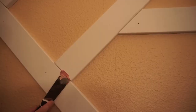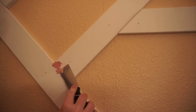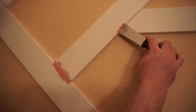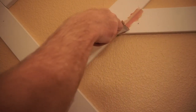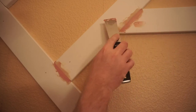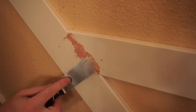Once you have all your boards up, it's time to start filling the gaps between them so that you have a nice seamless finish when it's done. I used DAP plastic wood — it goes on pink and then dries a natural color so you know when it's fully dried. When you're doing this, it is helpful to not scrape away everything from the joint that you're trying to fill. Leave a bit extra on top, and then when you come back and sand it, it helps you get a really nice perfectly flush finish.